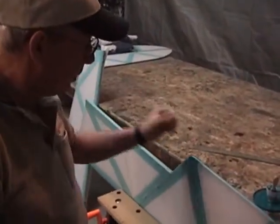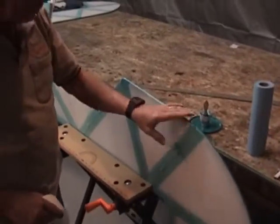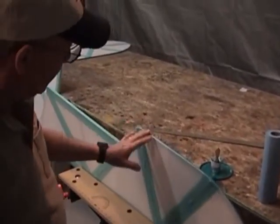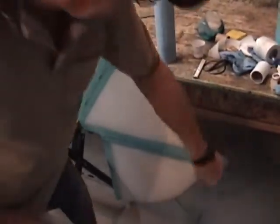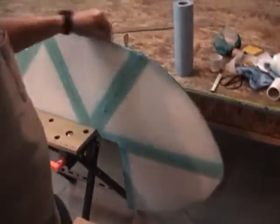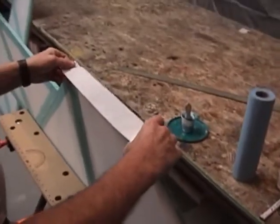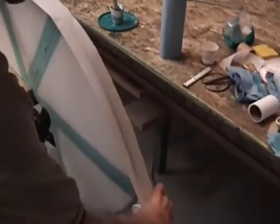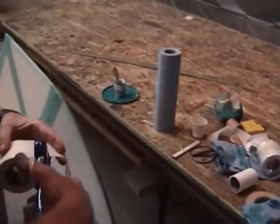We showed how to lay the tape on a stabilizer around the hinge area. Now what we've got here is the elevator section — this on a Citabria GCBC. We said before we've got a different diameter tubing on this, going from a large diameter tubing to a small diameter. We're going to take a 2-inch tape here. This is a straight tape. Just going to pull it around here and come past a little bit. We like to leave a little extra length — better off 3 inches too long than a half inch too short. Cut the tape off.